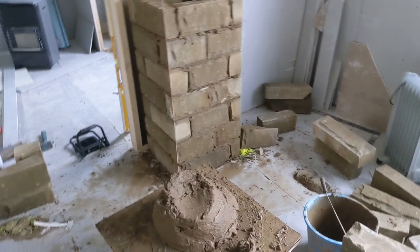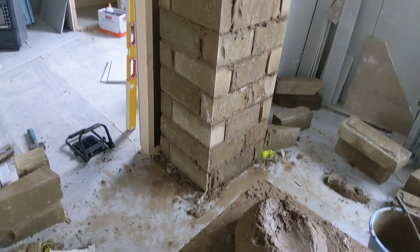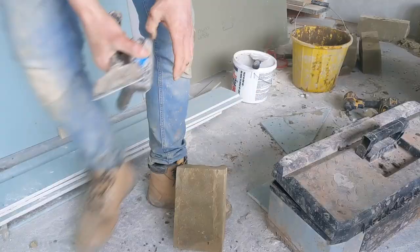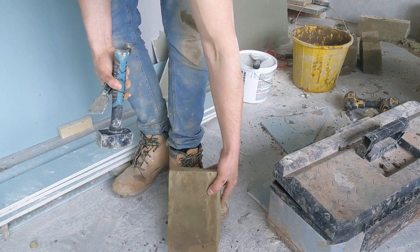It's just about midday and that's pretty much it so far. Slow start this morning trying to figure this stuff out, but I think it looks all right. Like I say, I've never laid stone or worked with this sort of material. So as a bricklayer, I don't know what I'm supposed to look out for. Obviously I'm keeping it plumb and in line, but apart from that I'm just kind of guessing. At the moment, this is an off-cut, so I'm just dressing the face so it looks about right — like it's been cut from a factory.